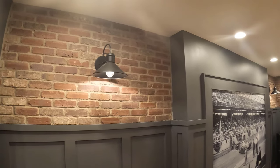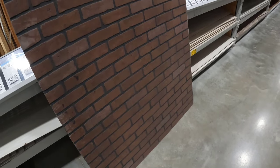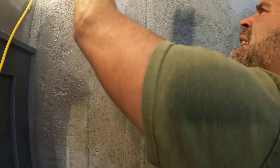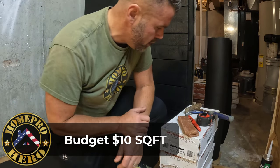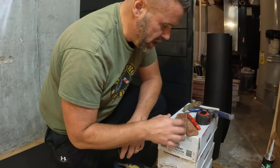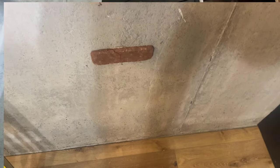I'm super familiar with this product — I installed it in my basement a couple years ago and fell in love with it. Some people call it fake brick or lick-and-stick, but it's nothing like that. The four-by-eight plastic panels at Lowe's and Home Depot that look like brick — that's a no-go. This is the go. To install it, I use liquid nails, which bonds concrete to masonry. I tested it on the wall and it was incredibly strong.